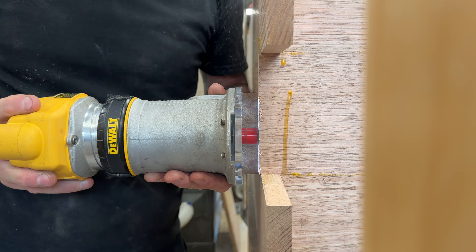Let's see if I can focus on this. You can see that's the hole that it will create, so now when I come back with my drill bit it will just fall into the center and those holes are perfectly lined up. It's kind of taking the idea of a self-centering bit — when I say self-centering bit I mean one of these — but because the amount of angle on the top is so shallow, it uses something with a lot more angle to it and makes a centered hole. If that makes sense.